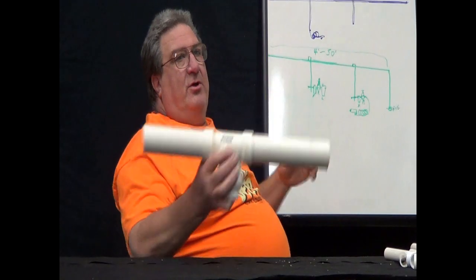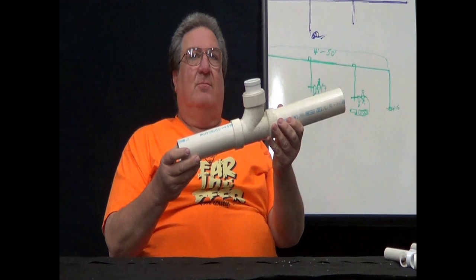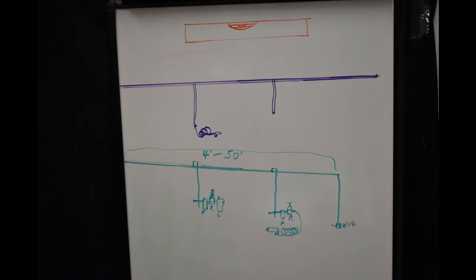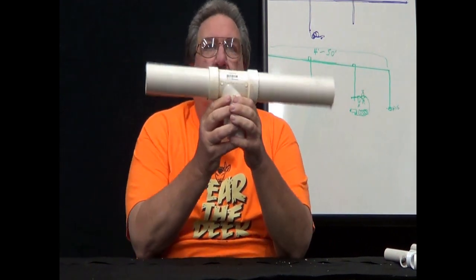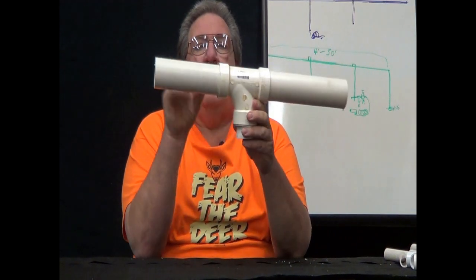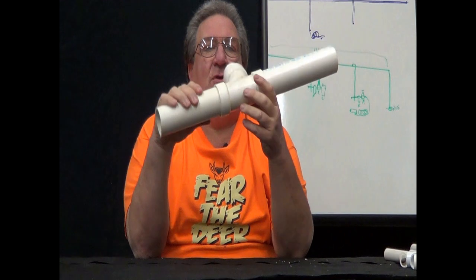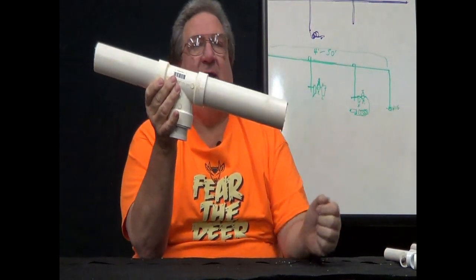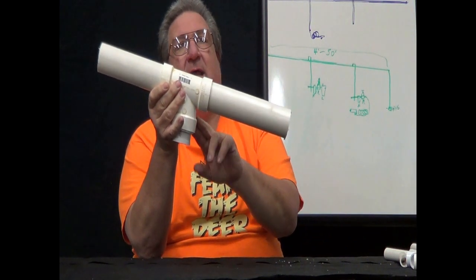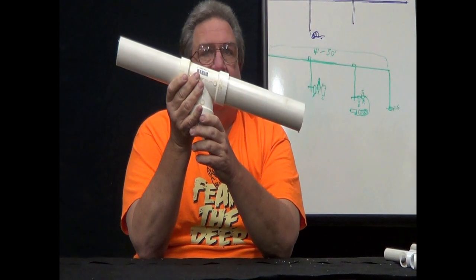What you want to do is have your compressor line running either uphill or downhill away from your compressor. In this little drawing in green, we ran it downhill away from the compressor, dropped straight down, and put a valve here — this is a big drip leg. When the pipe is level and air is flowing through it, water that condensates will drop straight down and go straight to your tools. But if you run the pipe off level, uphill from the compressor, the water won't get into your tools except what condensates past your drop. In mistake number two, I'll show you how to keep it out of your drops too.